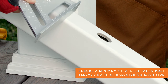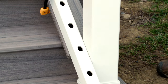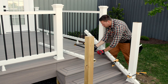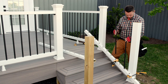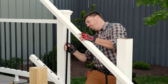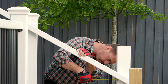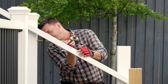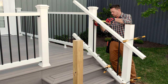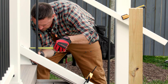This distance needs to be a minimum of two inches to accommodate the top rail bracket. Using a single clamp, temporarily secure the bottom rail to the side of the bottom post sleeve. Next, place a baluster at each end of the bottom rail to make it easier to measure the distance from the baluster to the post sleeve. With a baluster at each end of the bottom rail, place the top rail on the balusters. Position the top rail so that the holes are at equal distance to the post sleeve on each end of the rail. Now clamp the top rail to the outside of the post sleeves. With the space between the post sleeve and the baluster at the top rail set, adjust the bottom rail to match the top.